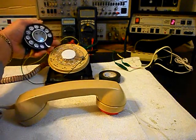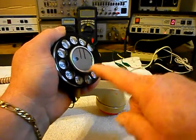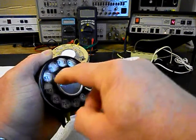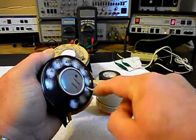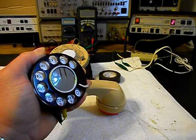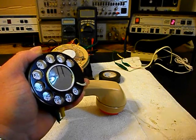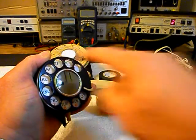I want to hang the unit up and give you dial tone. We're going to walk through our numbers again — if you watch the analyzer, you'll watch the numbers roll by. I'm going to end in a 2, and now we know our rotary is working and we can make some phone calls. We're going to push this button that gives us a line out and call a time and temp number. We have dial tone.